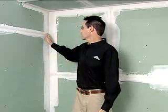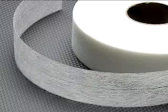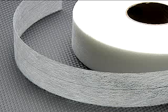The one issue was it being relatively easy to cut when you embed it in an inside corner and you use a regular drywall taping knife. So that's the one tool you want to avoid. Other than that, it's very similar to embedding regular paper tape, but you're offering your customers a mold-resistant product.